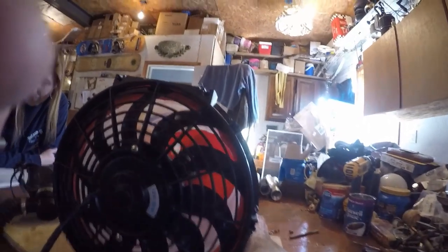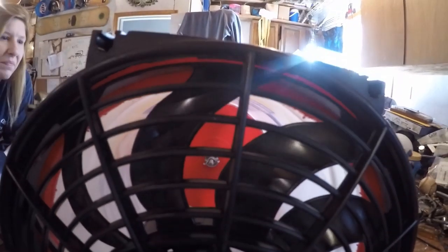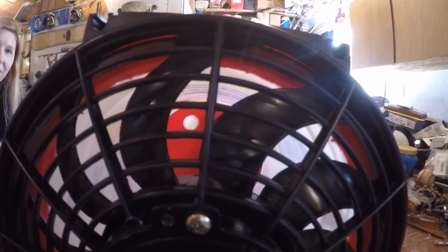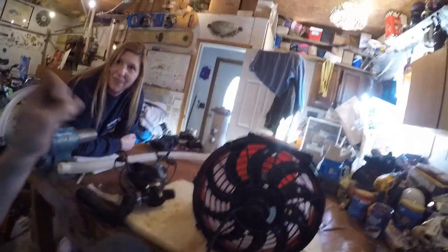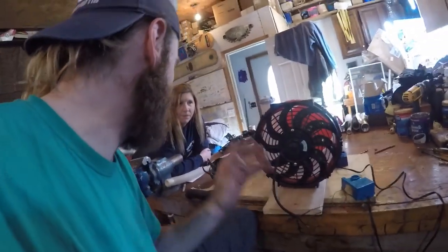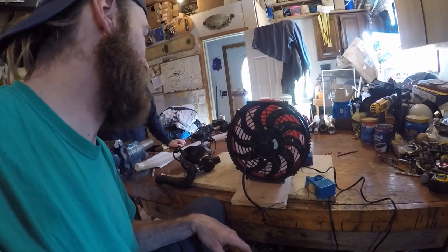All you do is you just turn that, and you could see the thing go around inside. Pretty simple little design. I can go either direction, and then when it lines up, it dumps the air right down through the hose. And that'll give you the pulse of your breath. And you should be able to time it, and hopefully it works. We just have to adjust a couple things so we get the volume that we're looking for, and make sure this thing can run for hours.